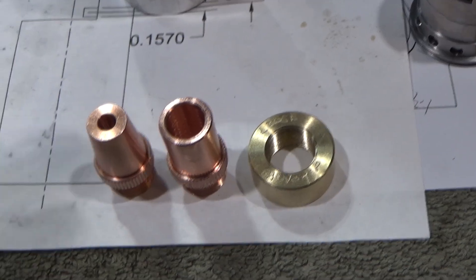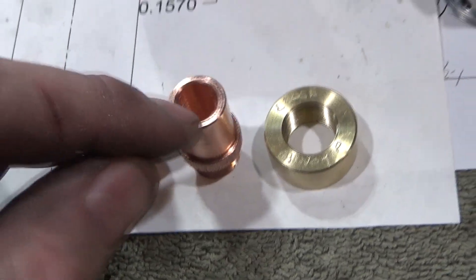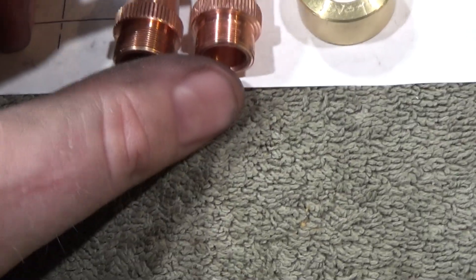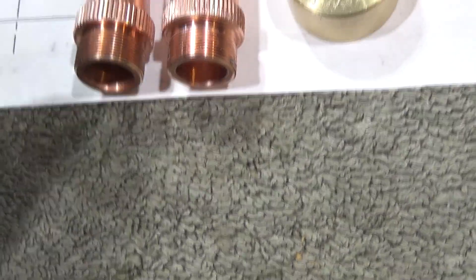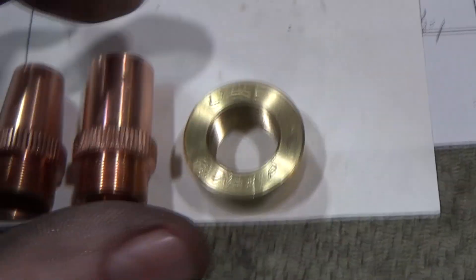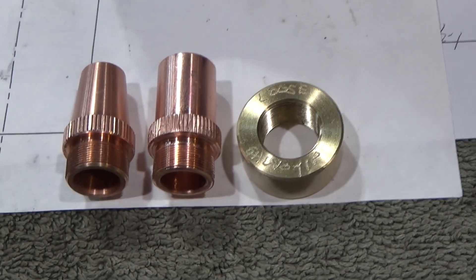Here are the finished tips. You can see the diameter is much larger going all the way through - the other one starts large and funnels down, but this one will let a larger column of gas through. My knurl wasn't quite as good as the factory original, but the threads are pretty reasonable. I've got a slightly larger relief zone - next time I think I'm going to try and shrink that. I've also got a gauge for next time when I need to check the threads, so that'll be really handy. That's it, thanks for watching, hope you find it useful, hope to see you next time.